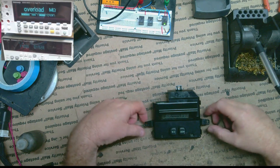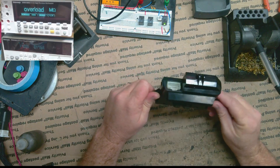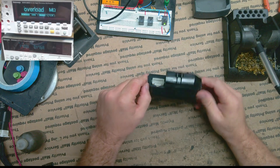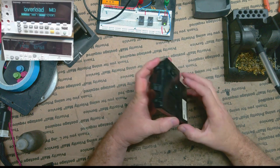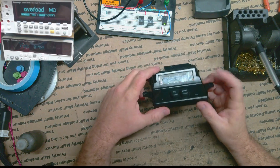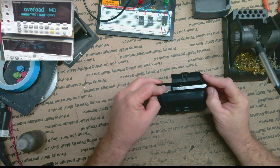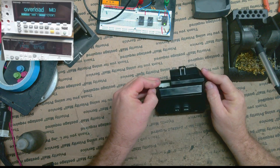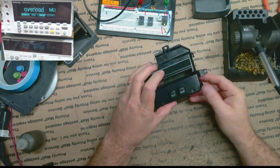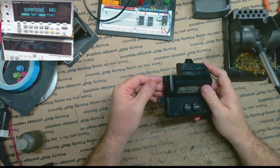I have a little module here that I don't see too often anymore. I used to see it once in a while but it's pretty rare these days — they're getting kind of old. It's from an older Expedition or maybe an Excursion, I can't remember. Basically the power goes out in them. It's a pretty simple fix — it's just some resistors that get overheated and become desoldered, or sometimes they just have cracked joints. The note said there was no power, so hopefully that's all it is.